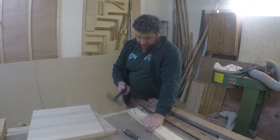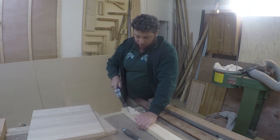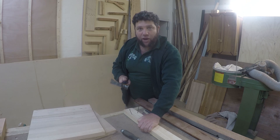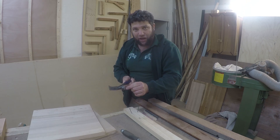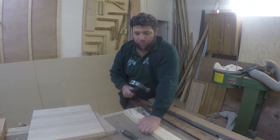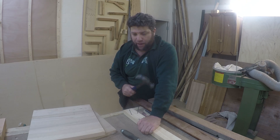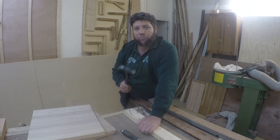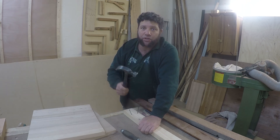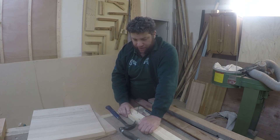Put all of those pieces together: I've got my special grip on my hammer, I've got a hammer that suits my hand, and when I hammer down I'm directly hitting the nail in the centre of the hammer. We've got a 20-ounce here. I use a 24-ounce on all of my building sites, and a lot of the apprentices I teach who are framers use 30-ounce hammers. I find 30-ounce hammers way too heavy, but they're there for a reason. You need to decide — play with these as much as you can and see where that takes you.